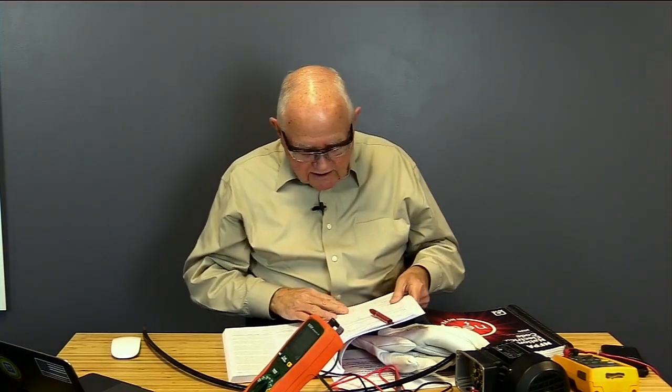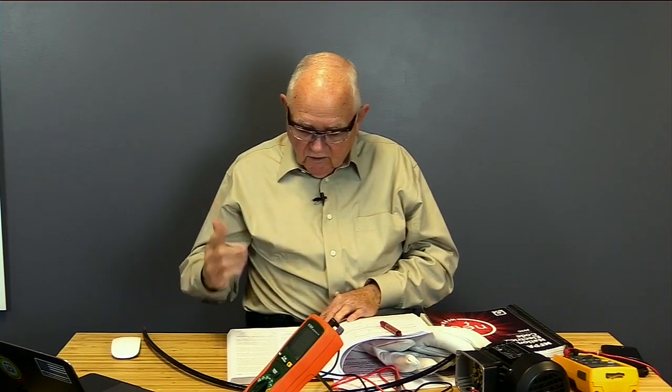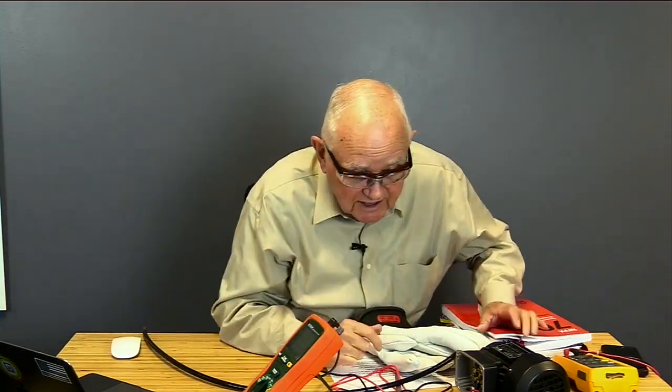Well, I'm going to go to Chapter 11. So Chapter 11, which has a lot of stuff in here, but anyway, Chapter 11, Table 11.20.1.2, rotating machine insulation testing. You probably got that memorized, right? Okay. Let's see, Table 11.20.1.2, rotating machinery voltage, 1,000 volts and below. The insulation resistance minimum has to be at least 2 mega ohms. 2 million ohms of resistance when I run this test that I'm going to do in just a minute. If it's less than 2 mega ohms of resistance, my motor has failed.